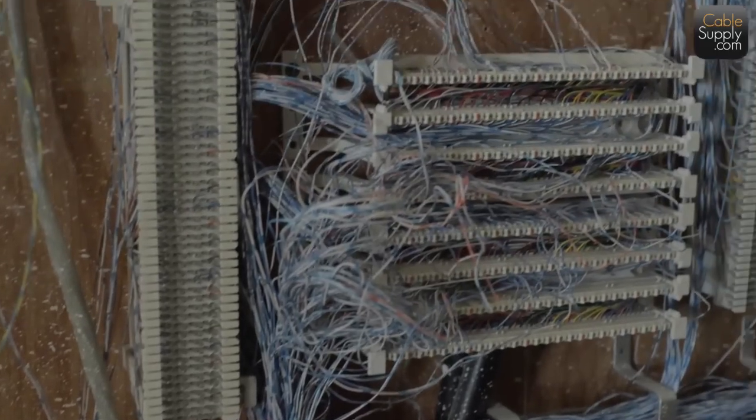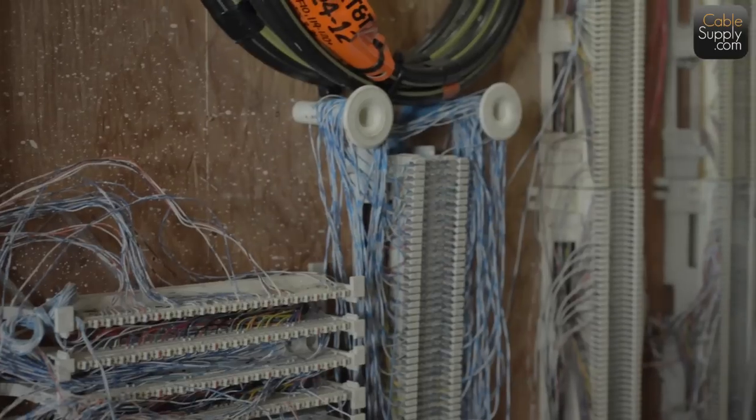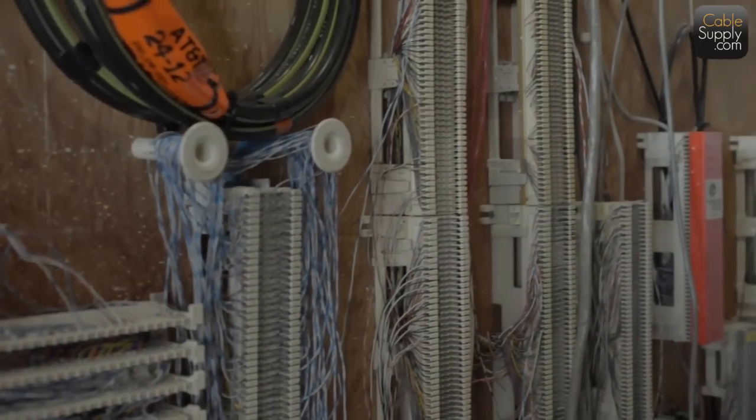Sometimes I don't understand. But they went on, and month after month, we kept on pulling more and more four pair cable, whatever they needed that month. Eventually we had, I don't know, 10 or 24 pair cables going from the third to the fourth floor. Glad we had pull string in there. But the idea is use 25 pair cable, especially for your POTS lines. And they buy them in big reels, 1,000-foot reels like that. Really very inexpensive.